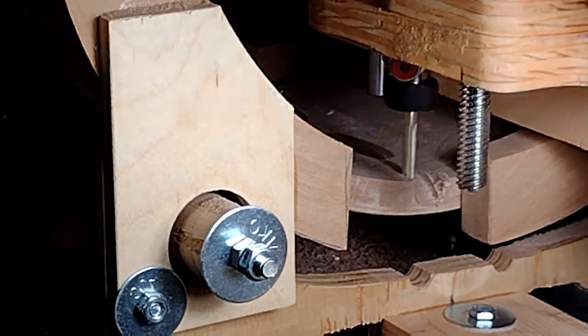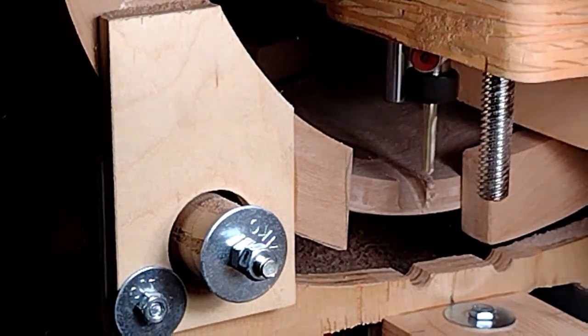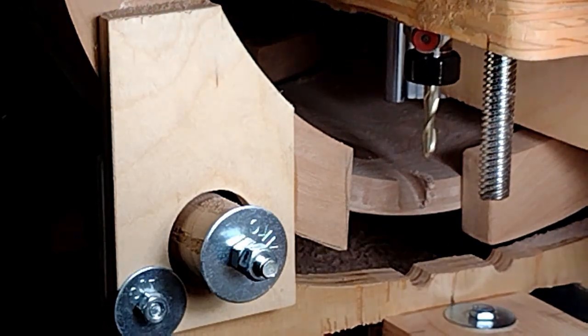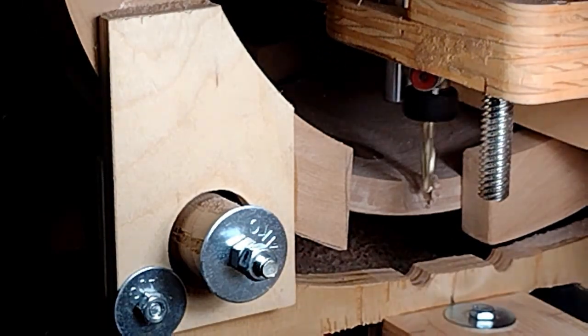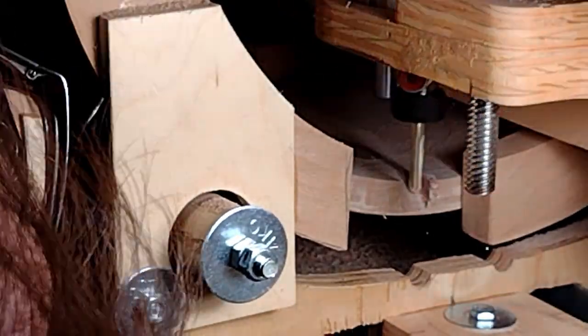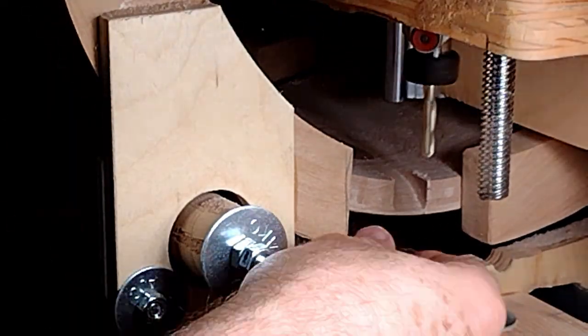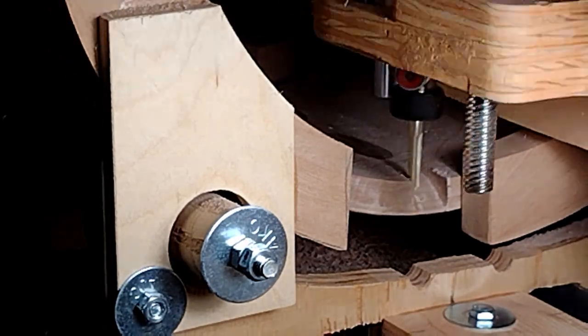The height adjustment was pretty easy — that one's normal, nothing special. The right side I keep creeping up another hundredth of an inch until I get it how I want. I'll keep doing a hundredth of an inch at a time — probably five or six times until I get it exactly how I want. Then when I'm happy, it's time to let her loose and let the CNC run for the next hour, then come back and go to the next step.